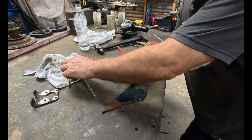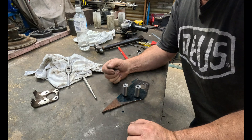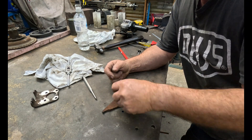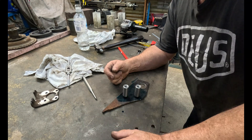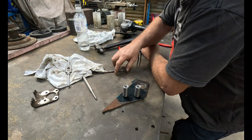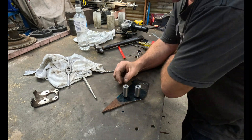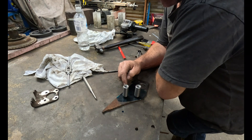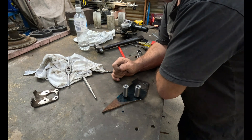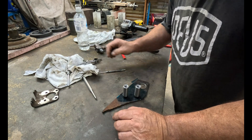I'm just marking out where these are — the two bosses — that will go across and bolt through the fork leg. I've shouldered these so they'll be a press fit, so I'll back-weld them. Looking at it from an engineering point of view, I think I might put gussets in here. It's just that the torque effect once the brake comes on — it's a fair moment to get that happening. I'll have a think about it, but it might be alright as it is. This will also give us our new profile for aesthetics, making it look a bit prettier than just a lump of metal.